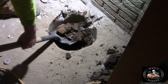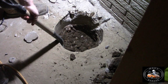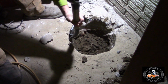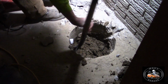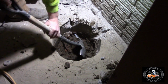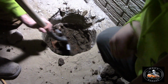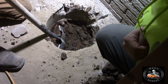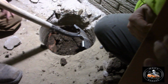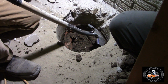Now here's where things get really tricky on the whole house, because these clay tiles were directed on the whole front of the house into this hole, and in this hole was a drain, and back in the day they thought nothing of running the water from around the house foundation in through that drain into the sewer and then flood out the sewer. Now city codes and everything have changed since then, and you are no longer allowed to run surface water into your sewage system, and this is the case here. So we had to stop work and reevaluate, and what ended up happening was we left it alone because I called a certified plumber and we told him what we were going to do, and he says as long as we did not disturb that pipe and merely dumped rock and routed the water that was coming from it into the new sump, we would be perfectly fine in just sealing it up with concrete and gravel and calling it a day.